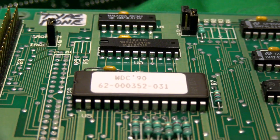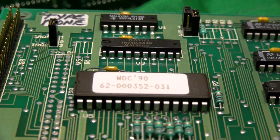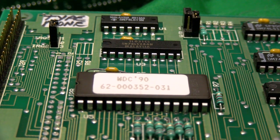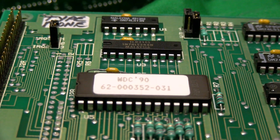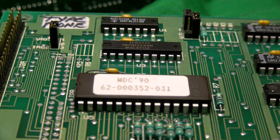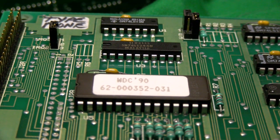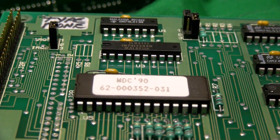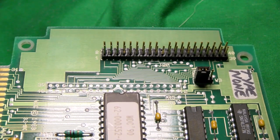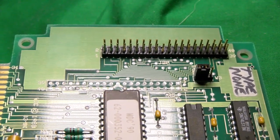This card, though, is a tiny bit unusual because it's an IDE XT interface, also called XTA, and XTIDE and a few other things. It's essentially an 8-bit implementation of IDE, and it uses different signalling, meaning the two are not interchangeable. And yeah, this also means it is different to the XTIDE cards you get now that will go in 8-bit slots. You couldn't just use the ROM from that with this and plug compact flash cards in. It doesn't work the same way.